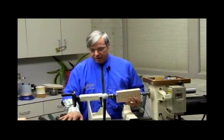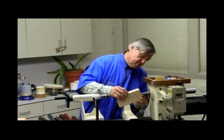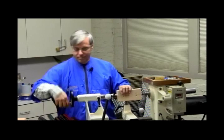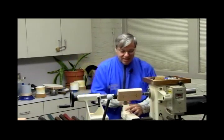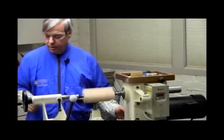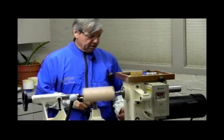So I don't have a face shield tonight, but I hope I won't need it. What you do is you first center it — they should all be marked with a center on each end. I'm half blind, so I've got a little center punch and I'll just let that spring load put the little hole in it. You need it centered. So I'm set to go there. The question is, what tool do you use? It doesn't matter — use whatever tool you feel comfortable with. We're doing spindle turning here, so it's okay to use a roughing gouge. So I'm going to start with that. Let me raise this a little bit. You always turn the lathe off before you move the tool rest.